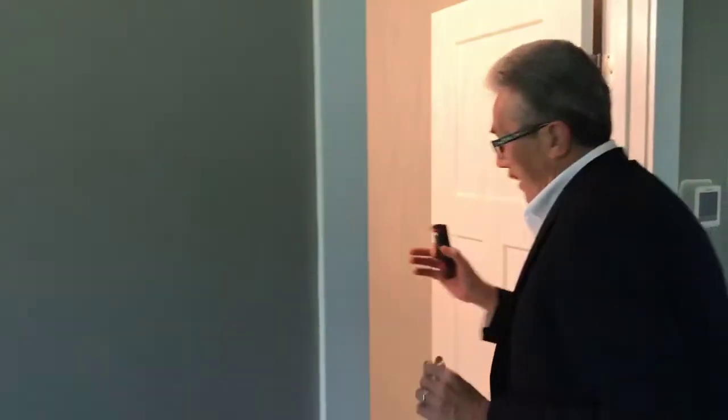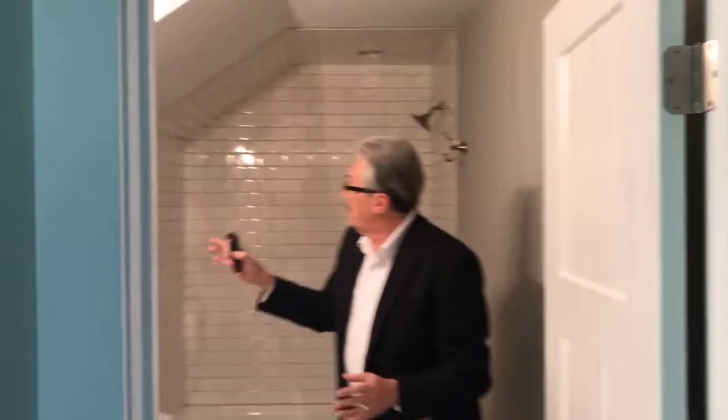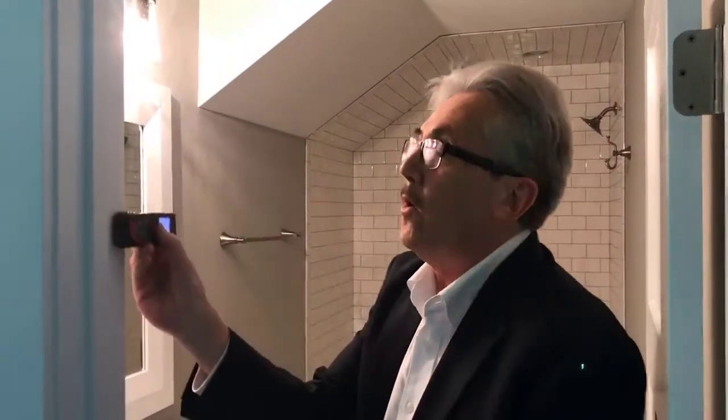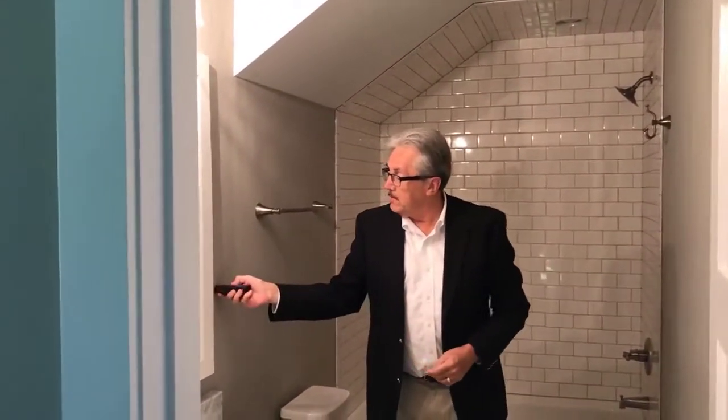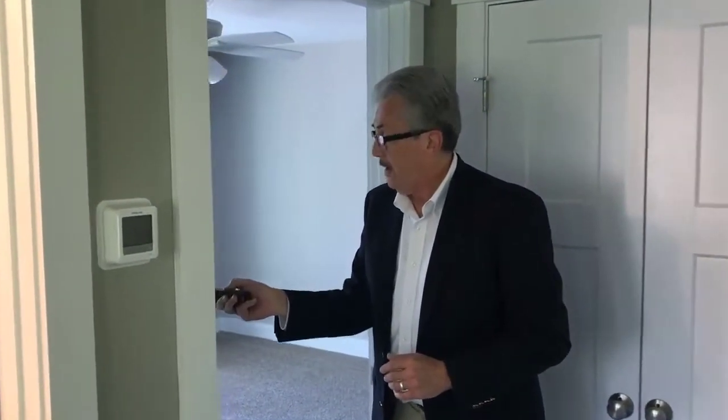For me, I'm doing the square footage, and unless they're hiring me specifically to do the floor plan, I'm just going to do a basic design, mark the exterior rooms, count the square footage, and label where the rooms are located. But in this case, I took the door frame and measured all the way to the end of this bathroom. I had also measured from the exterior wall to the left of that to that wall, so I can find the difference between that interior wall and this full wall that goes to the back of the bathroom.